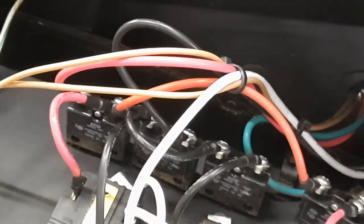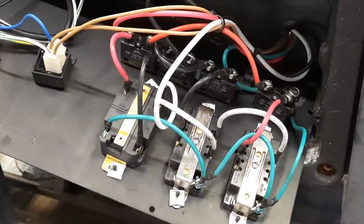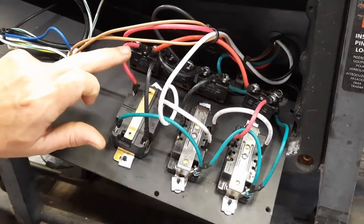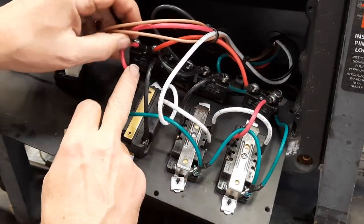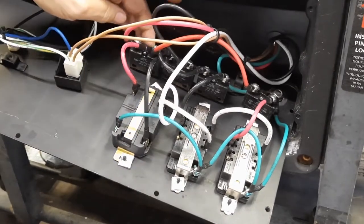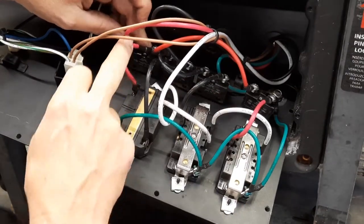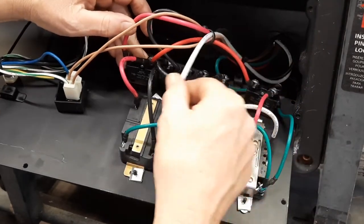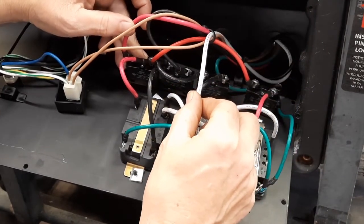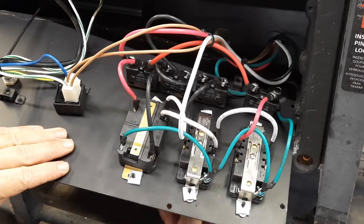I'm not positive, but I believe what that's telling me is that it's two legs of 120 coming in to this receptacle from the gen head. And when I trace it out, following from this breaker back here on the back, I got two different leads, one coming here and one coming here. Follow me? So let's just check all of these breakers. They're not tripped.